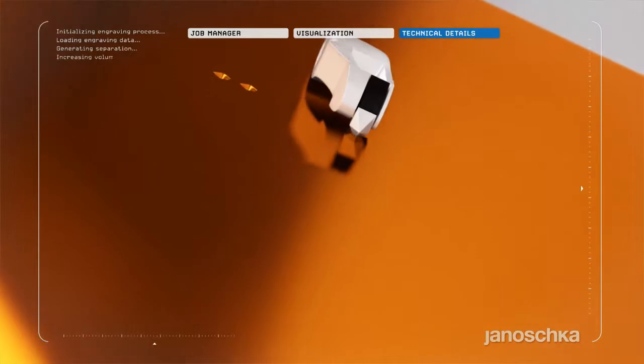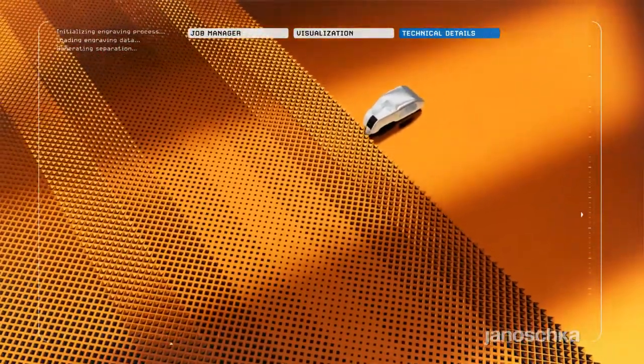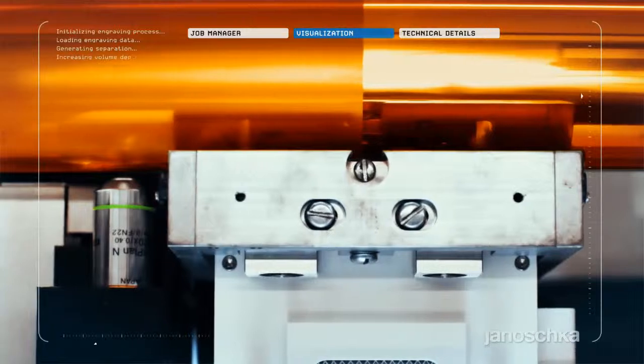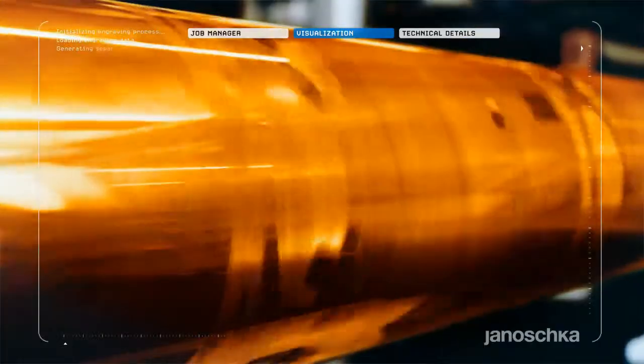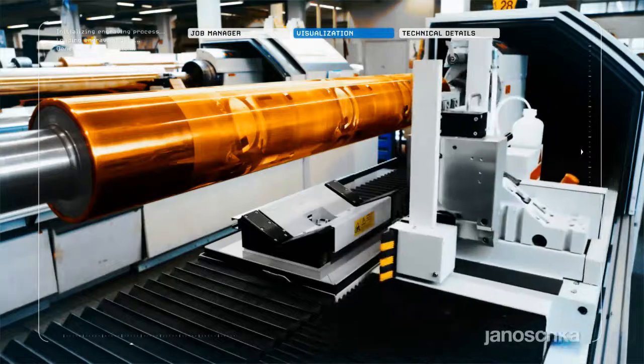Driven by electromechanical pulses, the diamond stylus engraves the so-called cells into the copper surface. The size and depth of these cells define the ink volume to be transferred on to the printing material during the print run, and consequently the color density on the printing substrate. All engraved cells reproduce the full packaging motif to be printed later on.